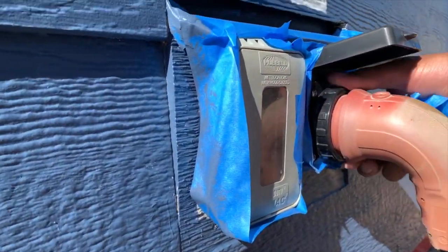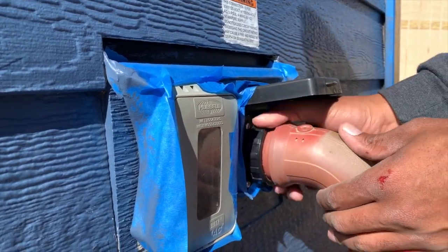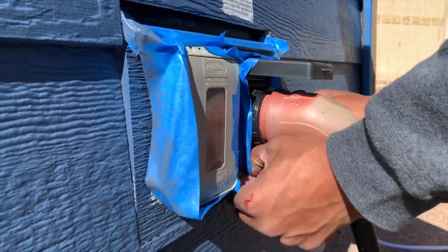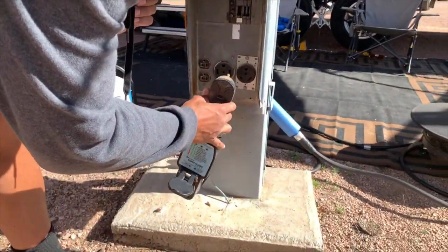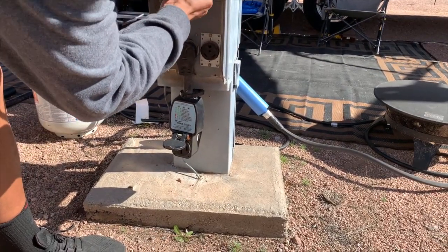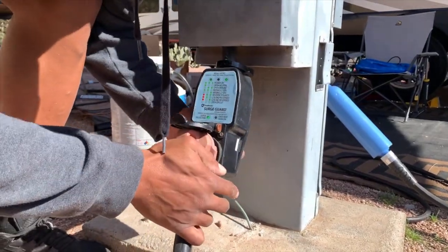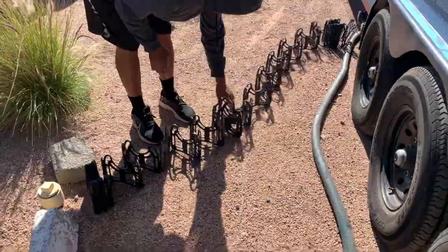While our builder did provide all of the basic connections for our home, we've upgraded and added some additional items that we'll share in the description below and discuss at the end of this video. Before we connect our electric to the new meter, we first plug in our surge protector, turn on the breaker, and wait for the all green. Our home requires a 50 amp connection, so since each connection has unique prongs, we know which one to use.